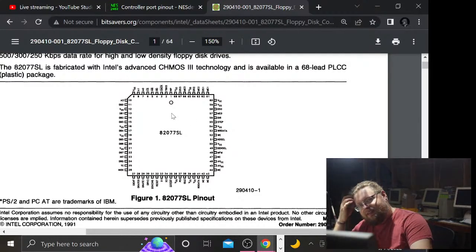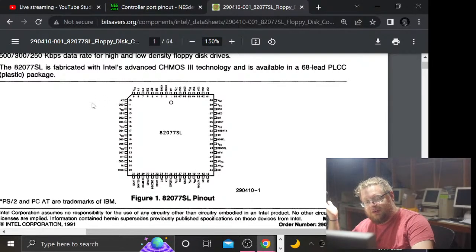And I was reminded at VCF, because I was saying one thing that we could do is set things up so that BASIC boots off the floppy drive and is just a booter program. Then I was reminded that you have to load BASIC into memory, and I have I think 8K of SRAM on this Super Mario cartridge because it has an extension RAM on it, which is nice, and 2K on board. I think BASIC itself is like 8 or 10K. So I would be out of memory once I loaded it off of the floppy. So I might have to add more memory somehow, which would be difficult because it would all have to be bank switched.